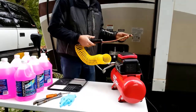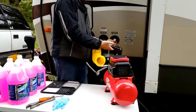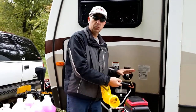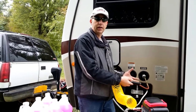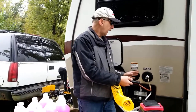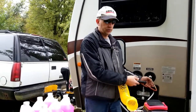What my wife is going to do when I go inside is take this and hold it up to the blowout valve and squeeze — that's going to pressurize our water system similar to the way the water pump does, but instead of pumping water it's going to pump air and blow the majority of the water out of the lines into the holding tank, which will eventually be dumped into our portable dump station.